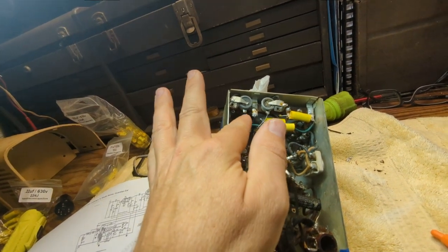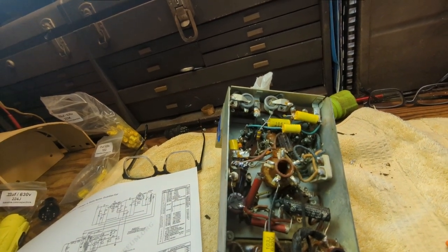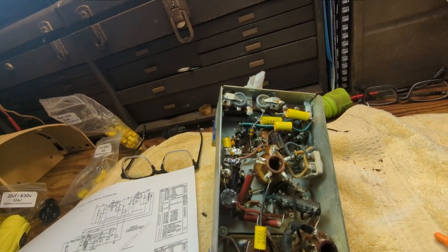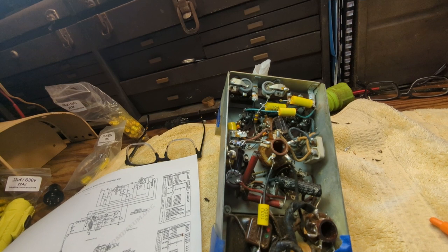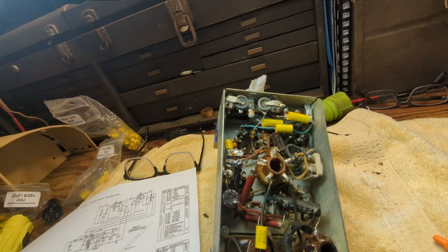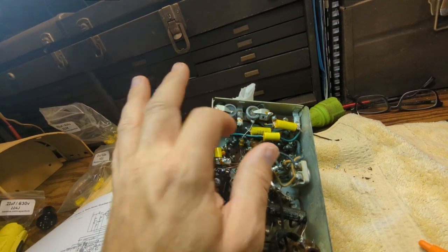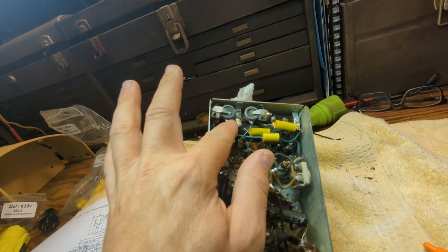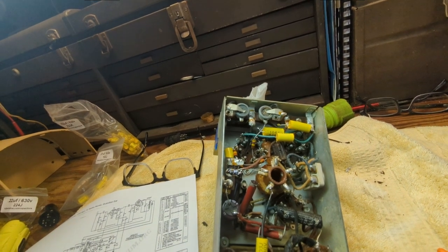And so that's the reason these guys are semi-permanently installed, because an old zinc carbon battery could sit on the shelf for years. And so imagine having this thing for 10 to 15 years, the batteries would probably still be okay. In fact, I'm curious, I'm going to measure these to see if they have anything left, which I doubt they do. This rubber material probably isolated the positive, which is the carbon top here, and the negative, which is the body. Well, that's probably allowed that to short out.